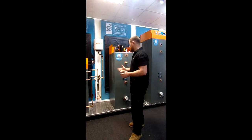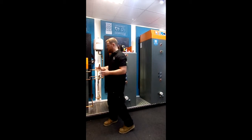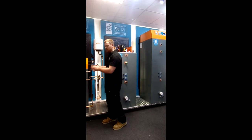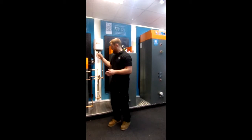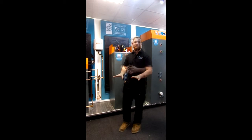The big Magic Thermodynamic box you see here is extremely well insulated, with a cylindrical cylinder on the inside encapsulated within a square casing, meaning we can maximise the amount of insulation that we put in there, with up to 222 millimetres of insulation in the corners. Okay? And with the definition of a high performance cylinder shifting from a cylinder that heats up quickly to one that cools down very, very slowly, what is a Big Magic Thermodynamic box?